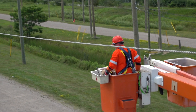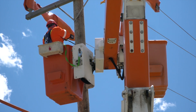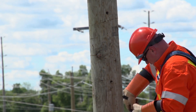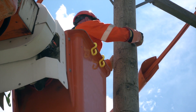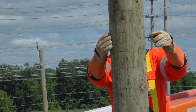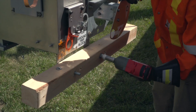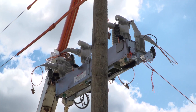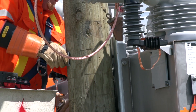Drill two 13/16-inch or 20-millimeter diameter holes in the utility pole at the desired height for mounting the unit. The centerline-to-centerline distance of the holes is 22-3/8 inches or 568 millimeters. Refer to the catalog drawing for more information. Insert two 3/4-inch or 19-millimeter diameter through bolts in the holes just drilled. Secure only the top bolt loosely with washers under the bolt heads and nuts so the heads of the bolts project approximately 3 inches or 76 millimeters from the face of the pole to engage the Inteliruptor mounting bracket. Hoist the unit to its mounting height and guide it so the top through bolt and washer projecting from the pole slips into the top hole of the Inteliruptor mounting bracket.